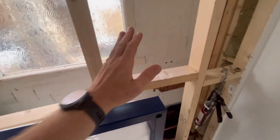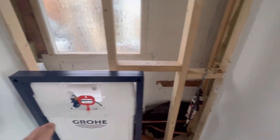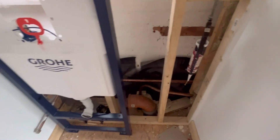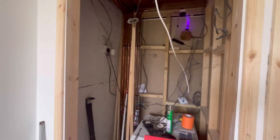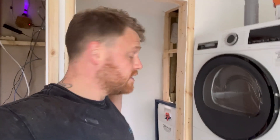I've set this stud out and today I'm going to have to reinforce that wall and move the studs - reinforce it a bit. I've gone across the top there, one at the side. There's a fixing hole there that can fix onto that stud just about, I think. I'll have to move that stud - the incoming mains is over there and pipework runs through the back. First thing we're going to do: get that stud work out the way and get the frame in position.